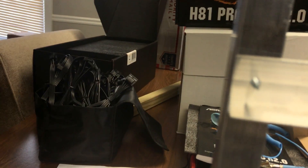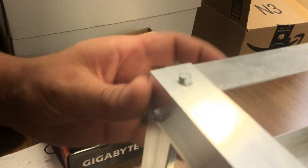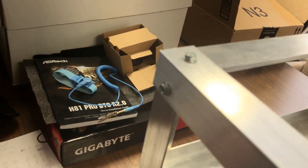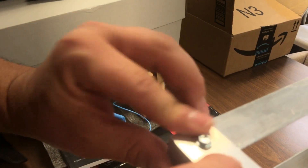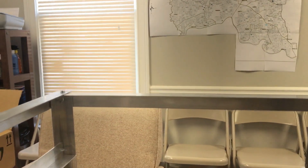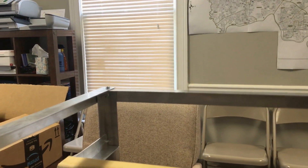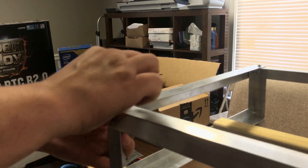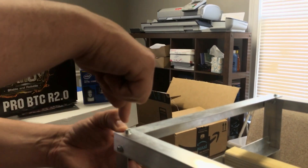The screws are self-driving screws, so I didn't pre-drill any holes. I found it was a lot easier to screw through one piece at a time rather than trying to screw through the entire assembly at once. So you screw through the top piece first, not both pieces simultaneously. Because the bracket is L-shaped, it can topple over, so you need something to support it while drilling — drill through the first hole, place the piece on top lined up, then drill through the second hole.